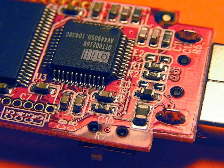Ball grid array BGA, a square or rectangular array of solder balls on one surface, ball spacing typically 1.27 mm, 0.050 in. Land grid array LGA, an array of bare lands only. Similar in appearance to QFN, but mating is by spring pins within a socket rather than solder. Fine pitch ball grid array FBGA, a square or rectangular array of solder balls on one surface.